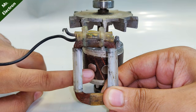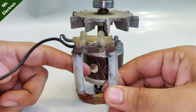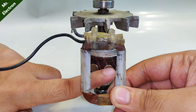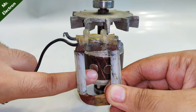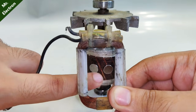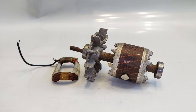When two magnets are inside the same coil simultaneously, the north surface of one magnet induces south on its front side, while the other magnet with a south surface induces north on its front side — so they fight each other. Whichever is slightly stronger overrides the other, and only the difference in magnetic strength is available to induce voltage in the coil, resulting in a very small output voltage. I hope you learned a lot from this video — keep supporting and learning, thanks and bye!